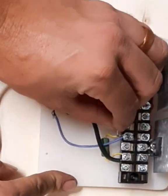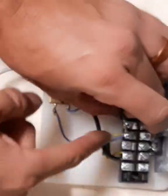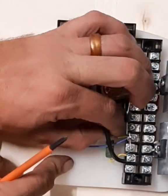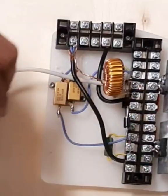Your main power source powers the inductors directly. Your variable power supply is always best to use because things can happen when you surge a ZVS. That's why I run the gates on a separate supply, because it will oscillate on its own without the main power source.